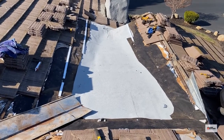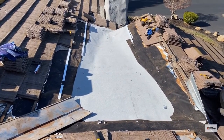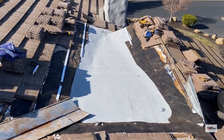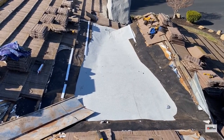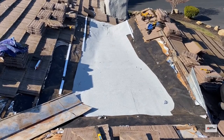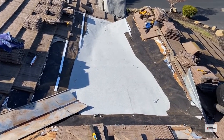When you have a low-pitched section on a roof, a lot of times the metal flashings the installers put in are inadequate — they'll rivet them down or won't even properly seal them. Ideally you want one custom-made, but in a case like this where it was multiple pieces of metal just overlapping, the best scenario is to overlap it with a flat roof application like this roll composition.